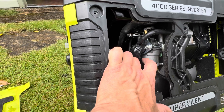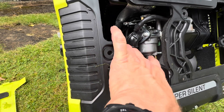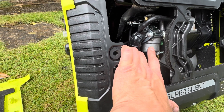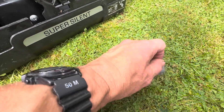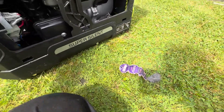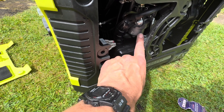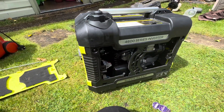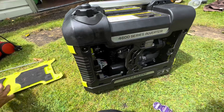Once this nut comes out, you clean it all out. Inside, just where the nut is, there's a brass fitting and you can unscrew that with a screwdriver. Then get some thin wire and poke it through the little brass jet inside there. Clean the bottom out with some wire, reassemble it, and then it just started. That was the problem on this inverter.